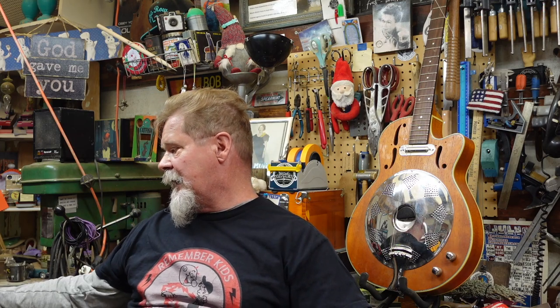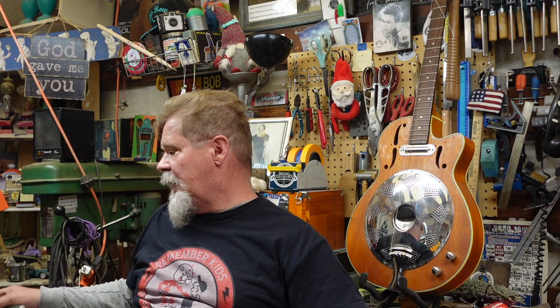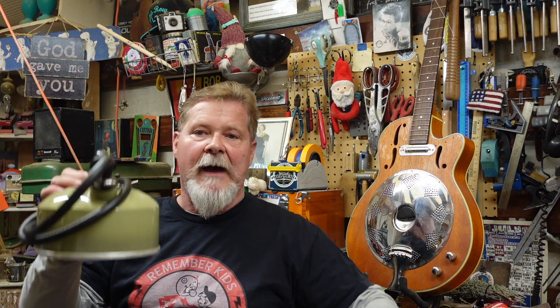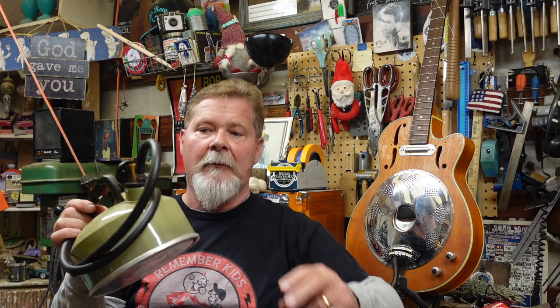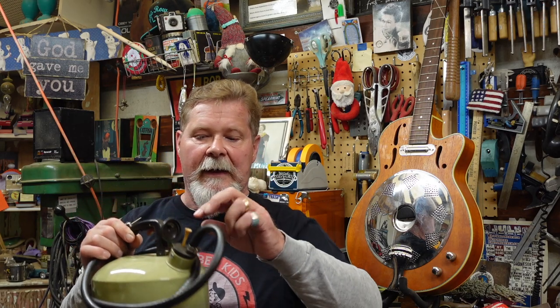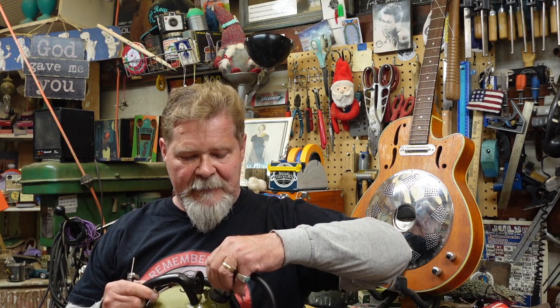We had some other episodes about how to steam off a neck - there's one up there that goes into all the minutia - but one of the things I taught you was how to steal your grandma's teapot. Yes, this is a 1964 Easy-Bake Oven avocado green teapot, and you make a neck steamer with a basketball inflator needle, some heat-appropriate hose, and a check valve for when the steam gets out of control.